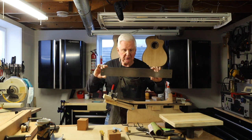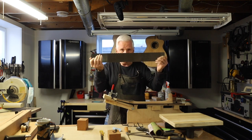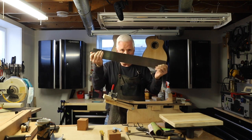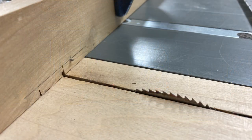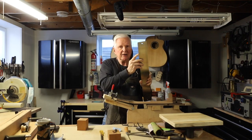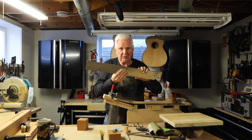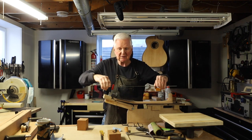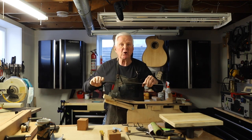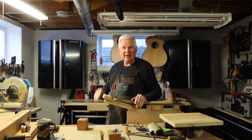So when I put it on to this particular jig, what happened is — to exaggerate — if this is the fingerboard, it would be like this. I got it on straight here on the bottom. And you'll see in the picture, the pin — which is the other part — what you do is you line that up so that there are little notches here in this jig, and your fingerboard, which is taped here with double-sided tape, simply goes on the table saw, and then moves across and cuts. And it does it perfectly. It's a great jig, and honestly it saves you hours and it's accurate.